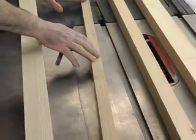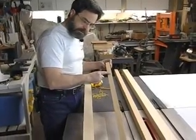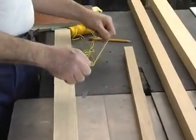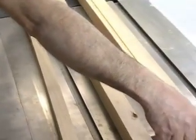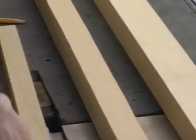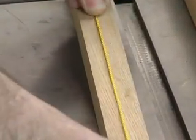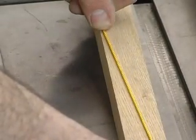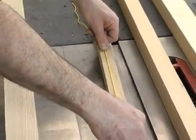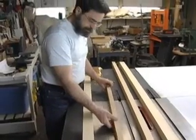The reason I kept this piece to show people: when it was a big piece of wood in the lumber yard, it had really fine grain and looked really nice. But what you see — and I'm going to illustrate it with this piece of string — is what we call diverging grain. On a perfect spar, you could follow a grain line all the way down and it's nice and straight. But in this piece the grain is diverging, not perfectly straight. You want to avoid that because there's a chance the wood would break along that shorter distance. If the grain is diverging, it's not acceptable. This was a reject I kept to show people.